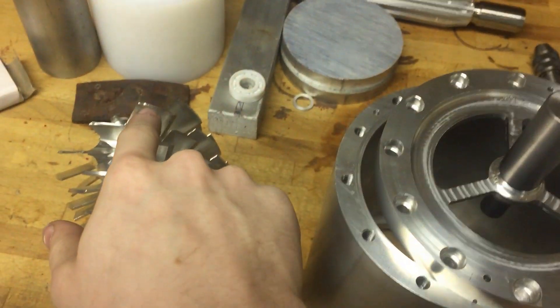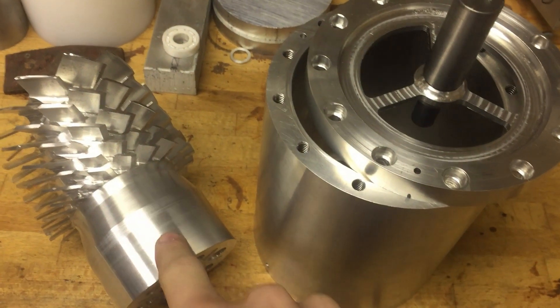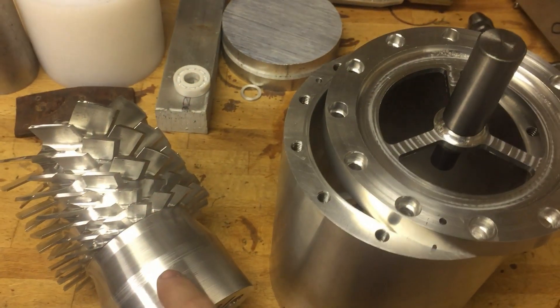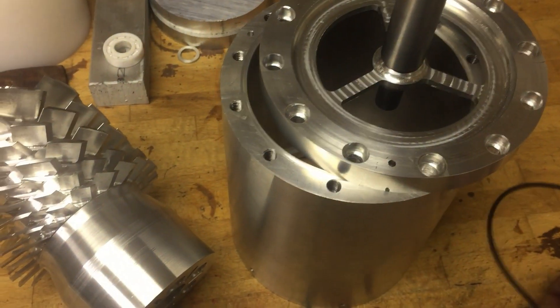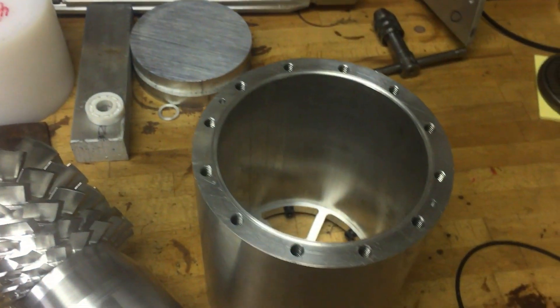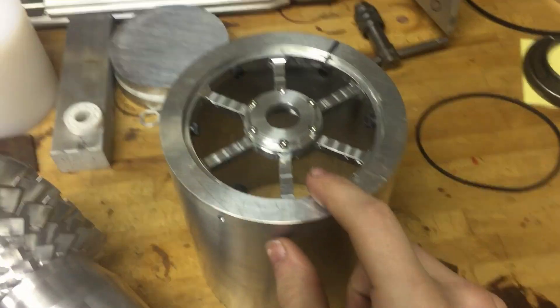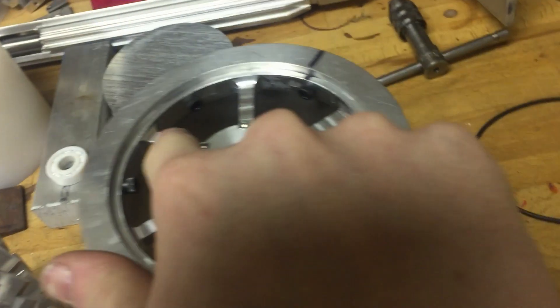That's why one side is floating, the other side is rigidly mounted. This side is the low vacuum side, which is to say it's normal vacuum, not extremely high vacuum. So just a normal O-ring is okay to seal it on this side — that's not a problem. On the other side, that's the high vacuum side. You can't just go ahead and slap any old O-ring on there and expect it to work, which is why this spoke assembly that holds the bearing is on the inside.